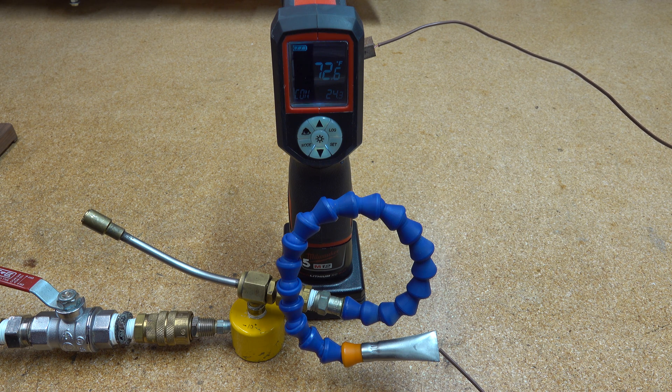Bottom line, you can now have super cold air pumping on your parts, so you can machine everything faster, drill everything faster, do everything easier — because you're not waiting for the heat to dissipate, and you're not worried about your tool turning blue because you're removing too much too fast. This is typically going to move ahead how fast you can get your jobs done.